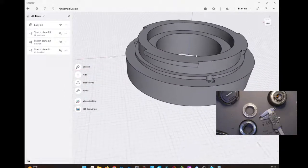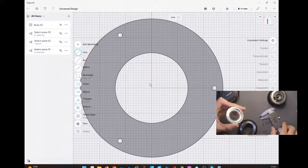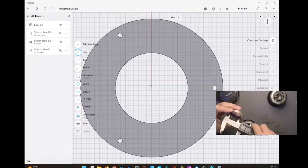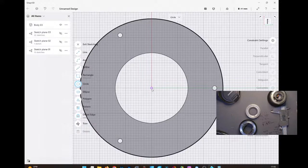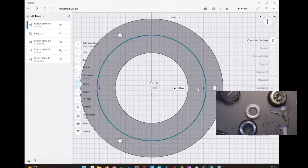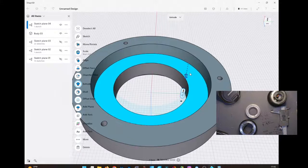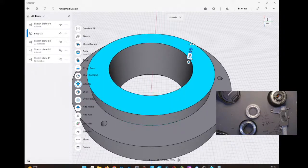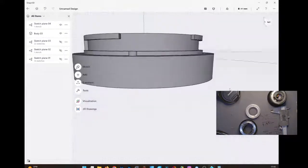So rough lens mount, that is it, right? We can also inset this area similar to this, right? We don't need a lot of this material, maybe they take quite a bit of that out, and the radius 42, that's quite a bit, 42. Sure, let's do 42. See how that works. Then we can take that and drop it like 4 or 5mm. In the end, sure, you're still wasting material with support, but I think it's better than actually having to print that fully out. If you feel like you need that extra amount there, it's totally fine.